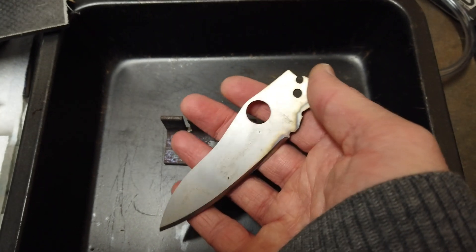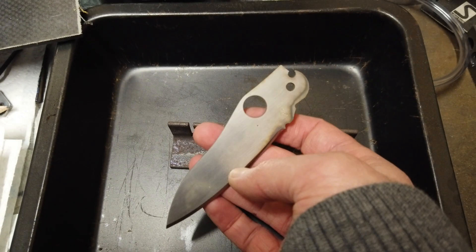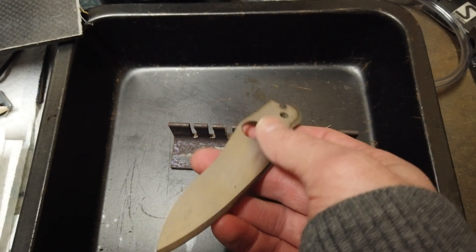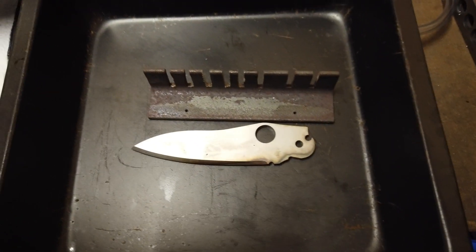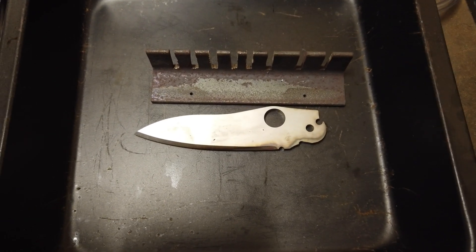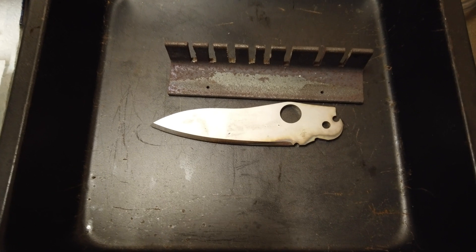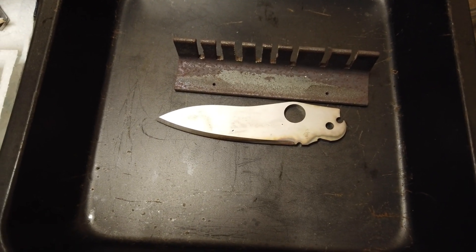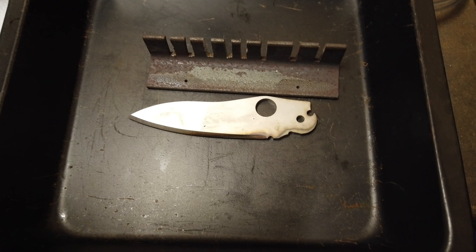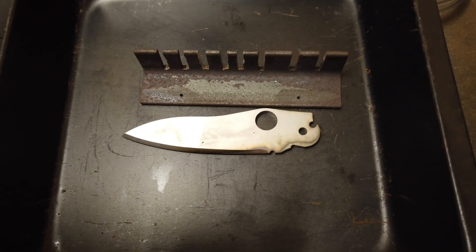Usually with RWL34 I go to a bit lower temperature, so I haven't really had any problems with the foil sticking — I think that's mostly related to the higher temperature needed for Magna Cut. We'll see what happens with the next batch and I'm going to continue to experiment. If I find something new I might do another video on it. I hope anyone that's watched this has found the information useful. If you've tried using argon to protect the blade from discoloration and you've got any helpful hints and tips, let us know in the comments. Thanks for watching everyone.